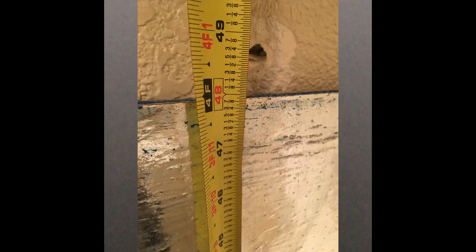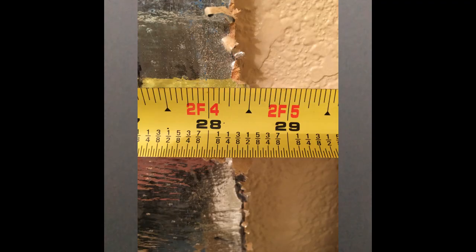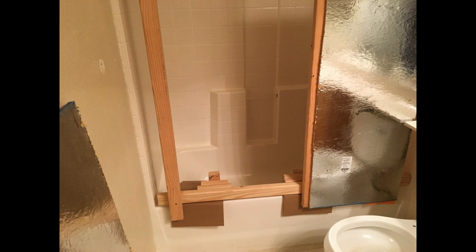It's important when doing this to keep things separate. The reason I got this plywood — a four by eight sheet — is it's seven-sixteenths, the same they use for roofing sheathing. It was actually the same price to get the silver-covered side. It's a dual purpose: one, it's the same cost, and two, if they lean against it and slide down, they're not going to get any slivers. It keeps it safer for everybody in the process.